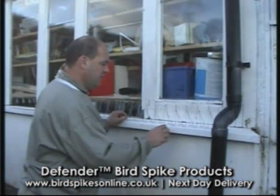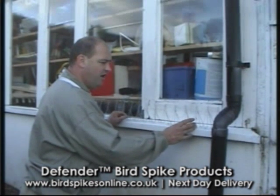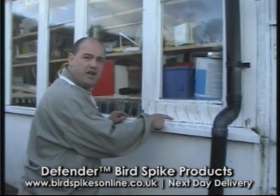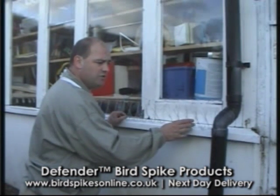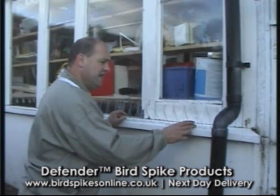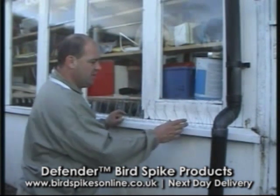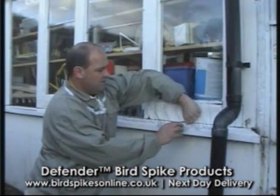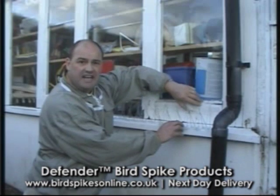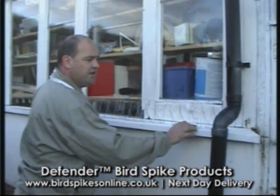Another point here, that this ledge is only 4 to 6 inches wide, so one row of spikes is perfectly fine there. In fact, if you measure the width of that ledge, anything up to 8 inches, one row of spikes will do. If it's more than 8 inches, maybe more than 9 inches, 10, 11 inches, and you can get your fist in behind the spike, then I would say you need to put a second row on. But here it's 4 to 6 inches, one row is absolutely fine.